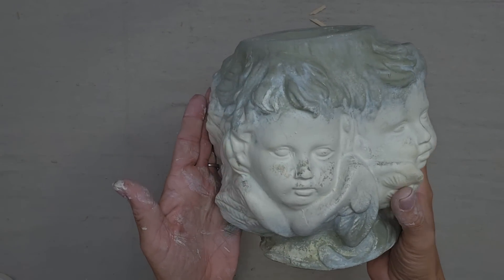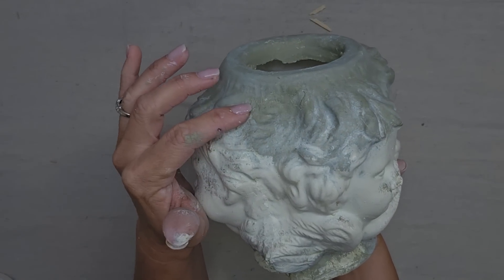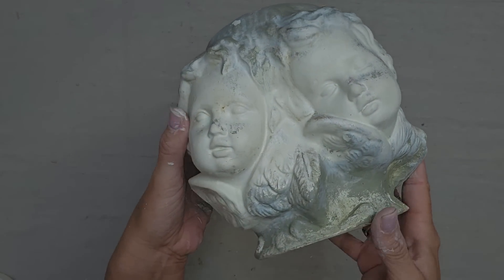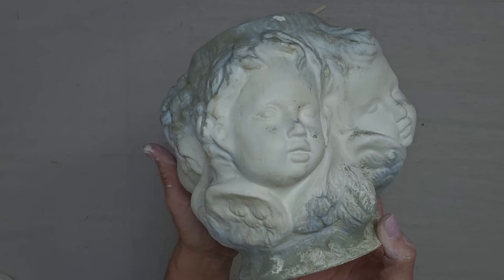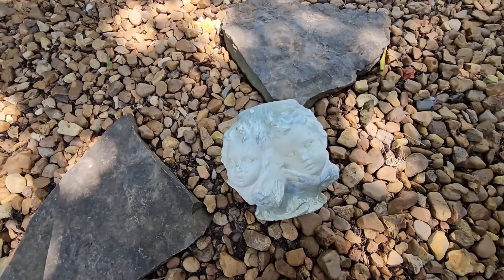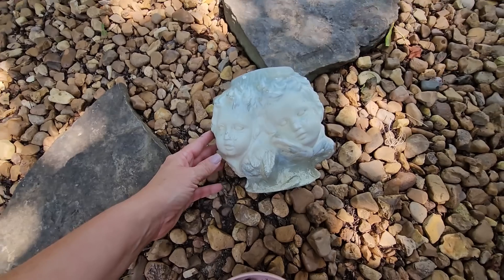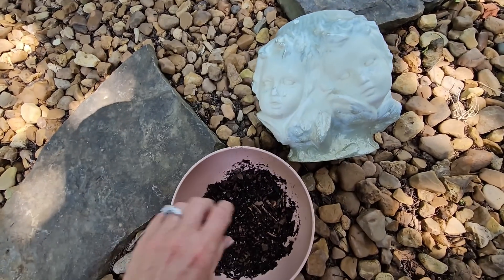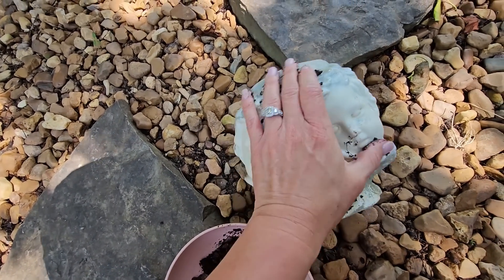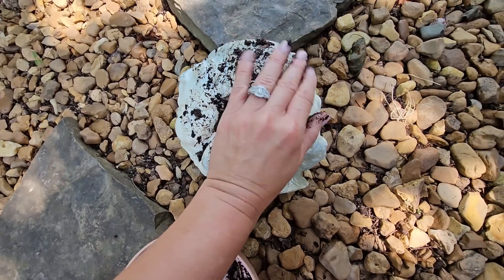I finished putting the Raw Silk on the entire piece and I think it is perfect. Even though I only added two colors — the Lichen to the top and the Raw Silk wash over the entire piece — you still have all of these other colors coming through, and it looks like this piece has been sitting outside forever. This is a technique I will definitely be using again in the future. I was editing this video and I realized that up close it looks very distressed, but when you look far away it looks a little too new, so I decided to add Nature's Own Antiquing Wax to add some dirt to this piece. I'm going to let it dry, rub it off, and then spray it with a clear sealer, and I really think that will give it the aged, worn look that I want.